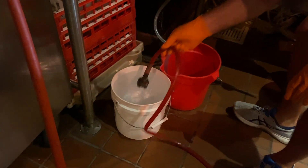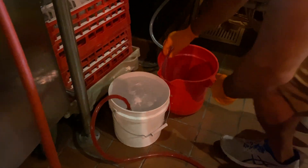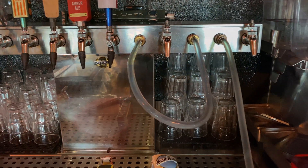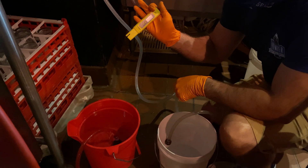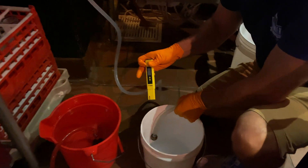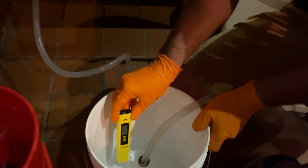When your 15-minute pump cycle has completed, you can begin your rinse cycle. Continue to add cold water as needed until it is completely flushed. Next, using your pH meter, test the water exiting your drain line and ensure the pH level has returned to that of your local tap water supply.